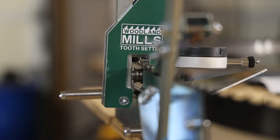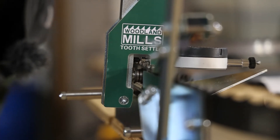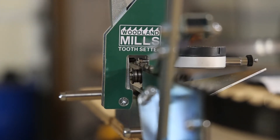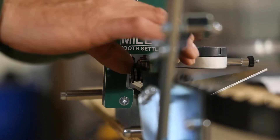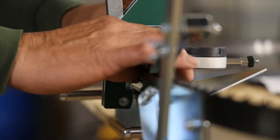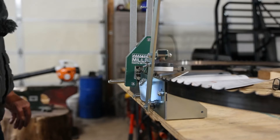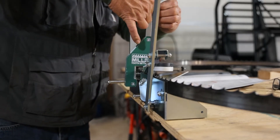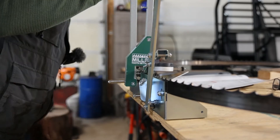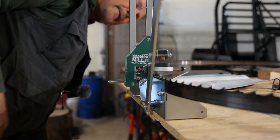We're going to squeeze our handles together and go a little bit over where we need to go — I'm going to take this up to about 46.5 to 47, which is .047 by the way — and bring that back, let most of the pressure off. Then I should be able to push that in to the indicator and I want a reading of .021, no more than .022. It's at .020 so I need to go just a little bit more. Now that I have two teeth set, I can just go ahead and go all the way through, and that should give me a perfect set on the left-hand teeth.